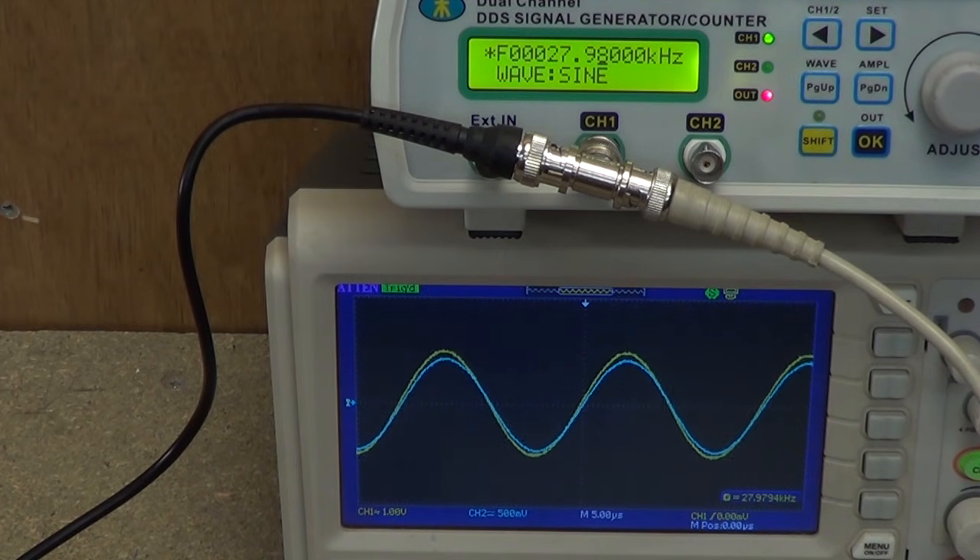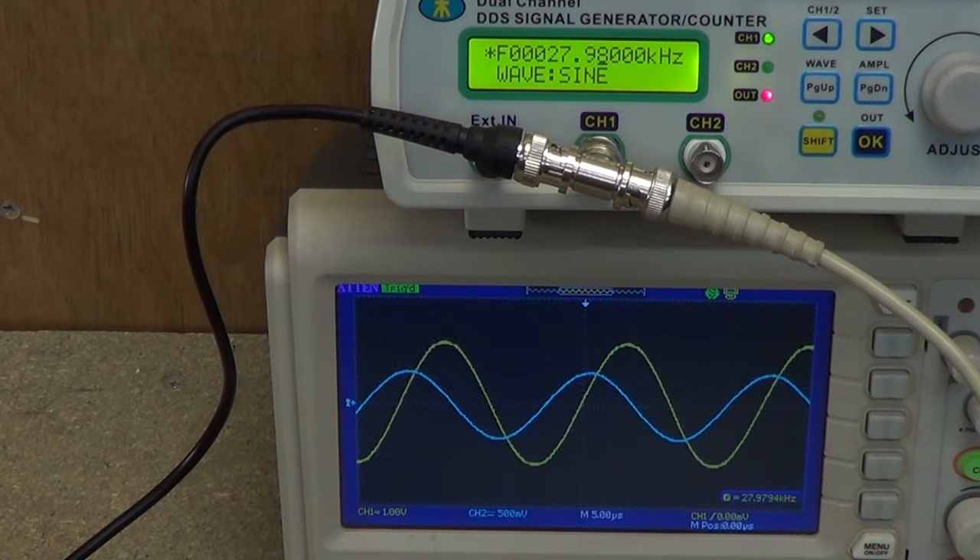So that's covered the basics of measuring resonant frequency, tuning horns, etc. I'll finish up with a couple of minor points and then run through a summary of the whole procedure. I mentioned back at the beginning that it's very important to use a sine wave in this particular circuit for measuring resonant frequency. You cannot — or rather it's much harder — by simply connecting the transducer to the output of a square wave inverter and trying to measure the frequency that way. And I'll show you why.